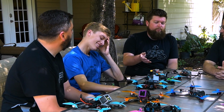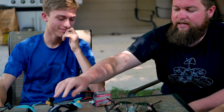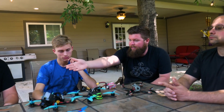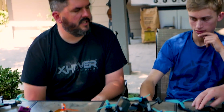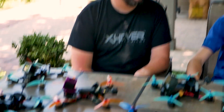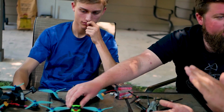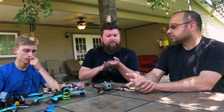To that point, one of the main things I did with this current frame when I designed it was, I was like, how do we get the best of both worlds? It's not super light, it's not super heavy, it's somewhere right in the middle. I also ran this through programs to do FEA analysis, which is a stress test. So I took all the highlight points out of where the stress on an arm will be in a crash, and then I reduced the number of standoffs from, Stingy, I think you have like 10 standoffs on that frame, down to 3. 8? You have 8? Yeah, 8. Well, you have your camera ones as well, right? 9. Okay, so 8, we'll go 8. General freestyle frames run around 8 standoffs. So we took it down to 3 standoffs, and we added a pod to help reduce... The lower deck reduces leverage? Lower deck to get that weight down, so it's lower leverage.